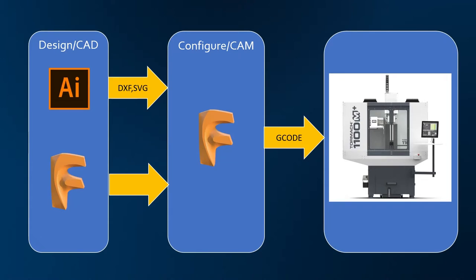In terms of their operation, we're working with three-dimensional files here. You can do DXF files, but that's a flat format — you would tell the machine how deep to cut it, and that will allow you to work with it. Or you're just going to take a 3D model and send that in. You'll notice Fusion 360 is the only thing listed here. This is going to be a CAD/CAM, or specifically in this case, once we have our model, we're interested in CAM.